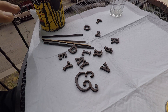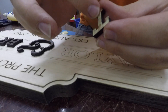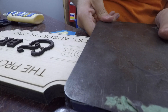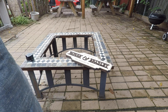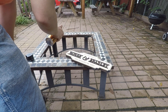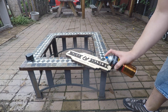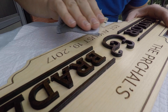After our individually stained and cut letters were fully dried and the stain was fully cured, we could glue them to our sign. I did a little bit of finger painting with the wood glue, applying a small amount to a few letters, placing them in their respective spot on the sign, and then using a large steel plate as a clamp for a few moments until the letters had done their initial drying. A chunk of granite would apparently also work here. After all the letters were placed and the glue was fully cured, it was time to apply the finish to protect it for the years to come. I decided to use Minwax quick-drying oil-based polyurethane for this, which sprays pretty nicely and looks super slick in semi-gloss in my opinion. I did multiple coats of the poly, sanding between them to get the best finish possible.